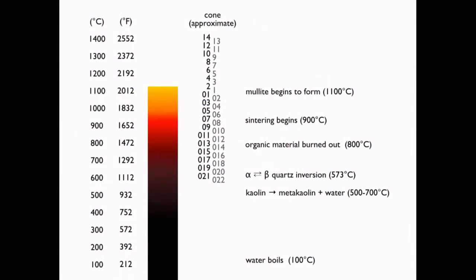And so it's only gotten to that bisque phase. Different materials are going to sinter at different temperatures. So even if you're firing it to maturity at these much lower temperatures, the elements in there are starting to fuse even at that lower temperature. So you have that property going on. But the old pots that were fired just in an open wood fire, those are within that temperature range. I believe it takes an enclosed kiln in order to get to those much higher temperatures.